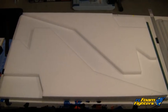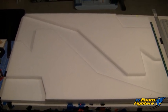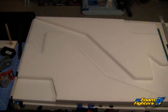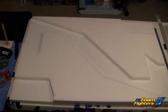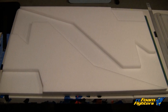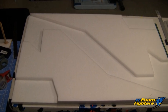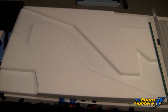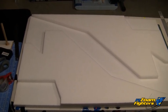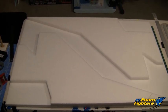The Supernova was a 34-inch wingspan. This plane is going to be a 38-inch wingspan. I am going to build it to the biggest size that I could fit on one sheet of foam. You can see the two halves of the plane I have already cut out. When put together, it'll be a 38-inch wingspan. On the Supernova and the regular Nova Jet, I used 30-millimeter EPP foam for the main wing. On this one, I'm only going to be using 15-millimeter — a thinner wing, hoping to cause a little less drag and maybe get a little bit higher speeds out of it.